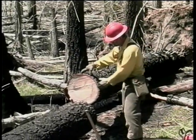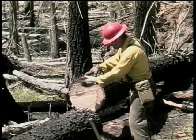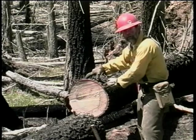Well, we didn't have much movement, but we read our bind properly. We were able to relieve the tension, come down from the top, finish our cut with the tip of our bar, and step back away.